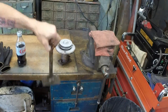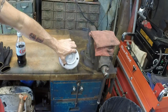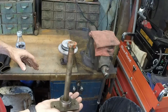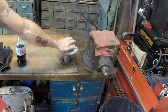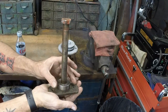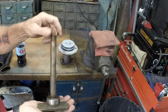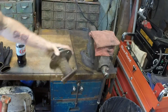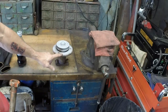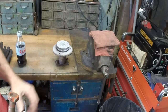This is what would be a center spindle, and this is the one I just rebuilt — I painted it just to let me know that I rebuilt it. If I needed a center spindle, all I've got to do is take all this off, drop that out, and put this one in. You would also have to make sure that you spaced and gapped it right so you weren't going to be binding the bearings. But you can use any of these spindle housings with the center spindle. Some of them have three holes, some of them have six holes — it doesn't matter. Dimensionally, they are all the same.